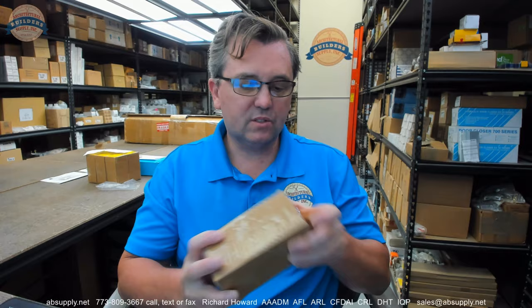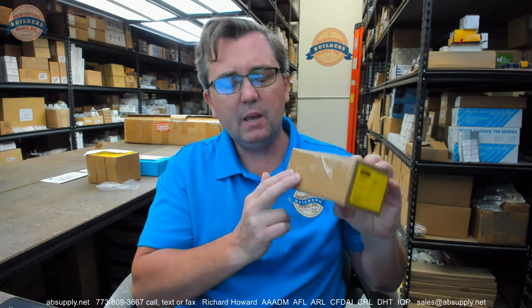Now let's take a look at what else is in this box, this package. Stanley has taken the habit of putting tape on the outside of the boxes — I imagine it's because it's coming from overseas; I would prefer if they did not do that. Now, what else is in the box: Stanley as a rule will send cardboard shims. They serve two purposes — they allow the hinges to be isolated from each other in packaging, but the shims are also perforated cardboard that will allow you to literally shim the door, move it around, cant the door in and out. Obviously not for use on fire-rated applications because cardboard shims are not permissible for use on fire-rated doors — you have to use a shim made of steel.